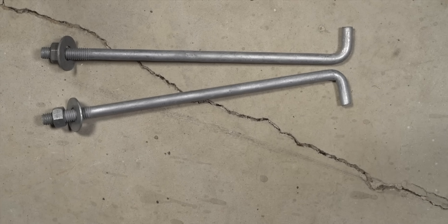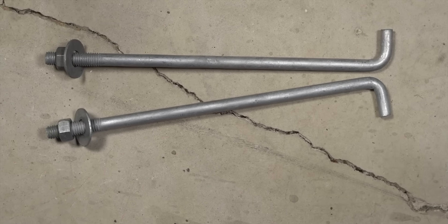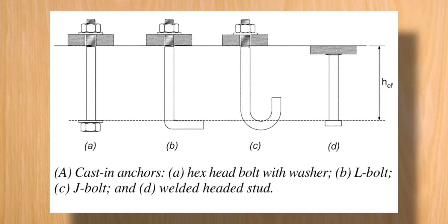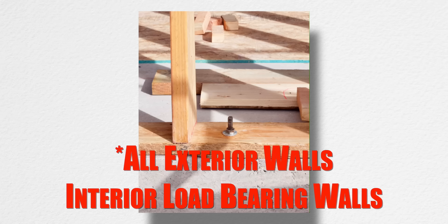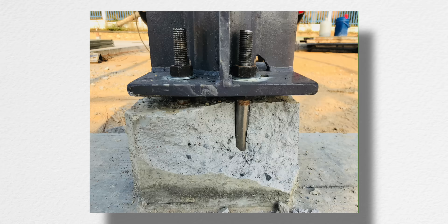This is an L-bolt, and if I see these on one of your projects I'm probably not gonna say anything, but I might give you this look right here. L-bolts and J-bolts fall into a family of cast-in anchor bolts where they're used to tie elements down to concrete. They've been used for decades anchoring your walls down to the foundation, anchoring deck posts down to the foundation, and by the steel industry to anchor down column base plates to the foundation. These things are very strong and very durable; however, engineers are phasing these out and just aren't using these on our projects anymore.